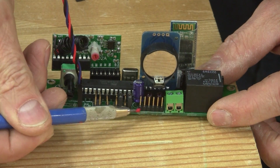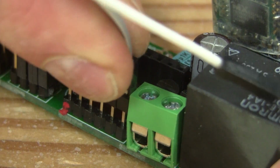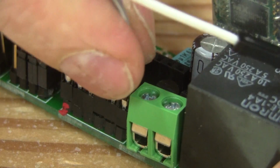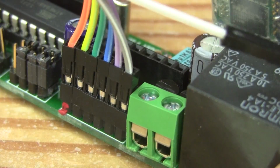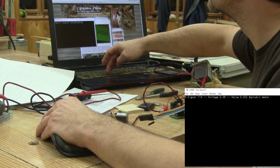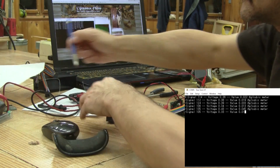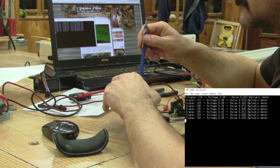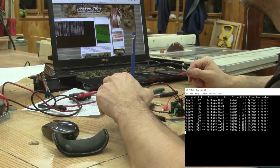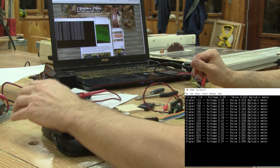Next thing to do is check the dust sensor. But first, I'll make a red mark where the red wire of the dust sensor should be and plug the sensor. The dust sensor's wire is plugged into another wire, and it's this one that I plug into the controller. Now I send a command that returns a non-stop readout of the dust level. This works great. But I still jam a pencil inside the sensor just to check if the readout changes. And it's confirmed, the dust sensor works like a charm.